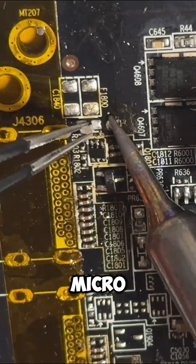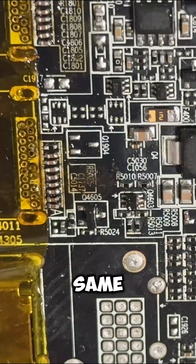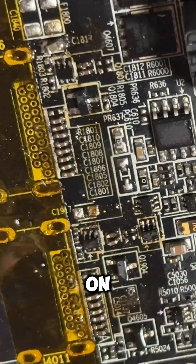Then we need a bigger 10 microfarad capacitor in this top spot of size 0603. Now we would do the same thing for the other display port, except here we add an extra SSM6N7002CFU on the right side.